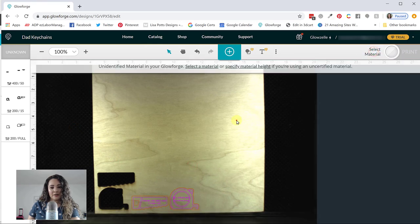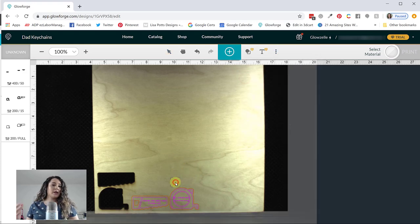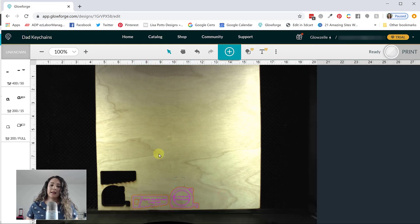We're gonna select my material, so we're gonna go over and set my focus. So whenever you're not using a proof grade material, you need to tell the Glowforge to check how far away it is. So it's setting the focus of our camera, and then this will help us figure out a better spot to place it to cut it. So this will just take a second to focus. All right, so you see it shifted just a little bit because of the focus. So I'm just gonna kind of nudge this up a tiny bit with my arrows,